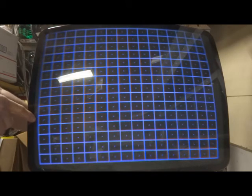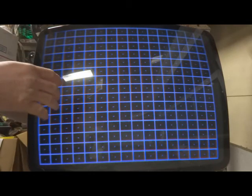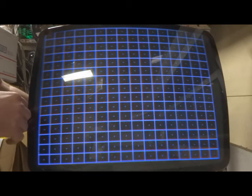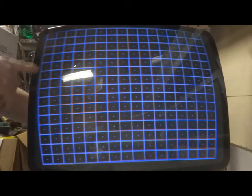So that's what you want to adjust on your 27-inch. It's a little more predominant on a 27. I'm running this on a 25-inch tube at the present moment, just because it's easier to get on and off the bench. But now you can see your trapezoid control. The other one's your Pincushion. This is your trapezoid. You see how it makes it to where you have a curve.